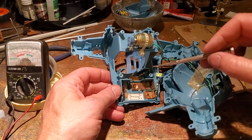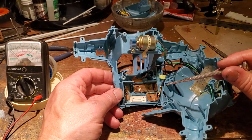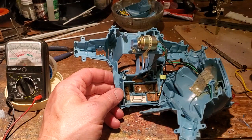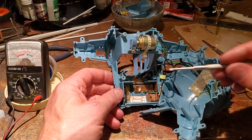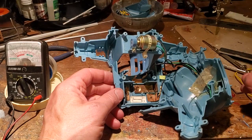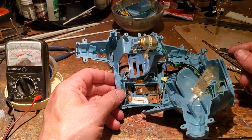Most of your continuity issues are going to be here because the batteries have corroded, or possibly these just need to be polished up a little bit. You can polish the contacts in a number of ways: you can use a screwdriver to scrape it off, but that's going to scratch the copper. You can use a nail file, or I used my Dremel tool with a wire brush and buzzed in there, being very careful not to hit the plastic tabs. Then you can use some Brasso to polish that up.